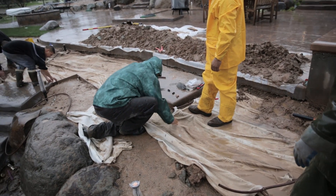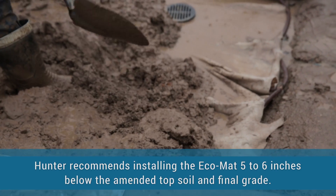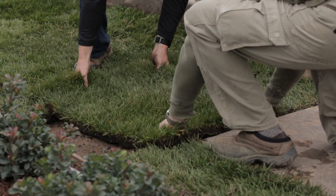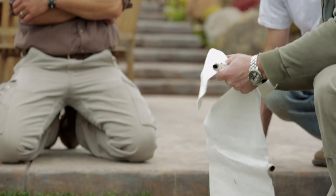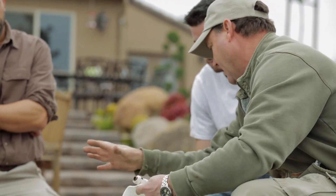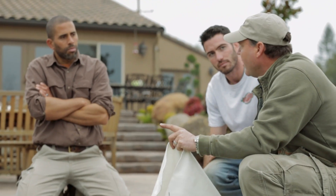The turf looks all the same. Yeah, they tell you they want it about three to four inches below the final grade of your soil. And then we cover it with our native soil — we don't bring in topsoil, just cover it with soil, get our grade set, and then the turf's ready to be installed like normal. What I really like about Hunter's Ecomat product is that you can get the inline drip emitter tubing with the cloth cover for skinny strips like this. You don't have to take a whole square foot of material and cut it down. It's been almost impossible to water narrow strips well, and this allows us to do that.